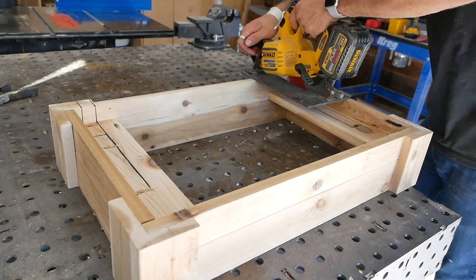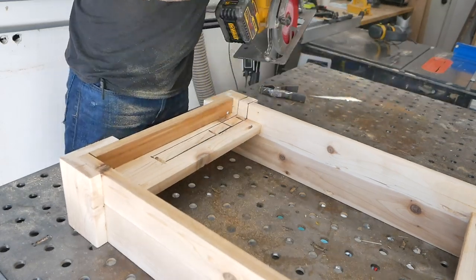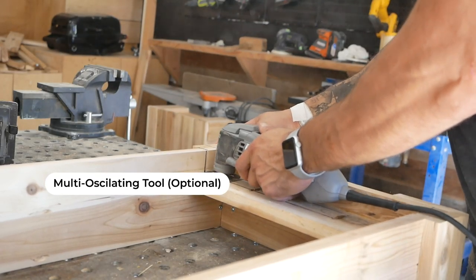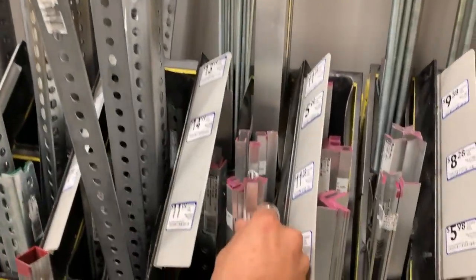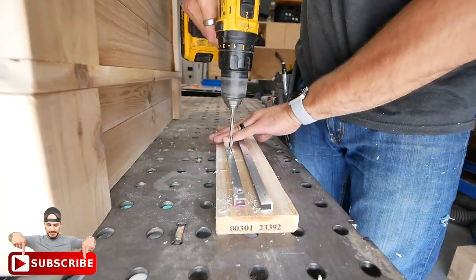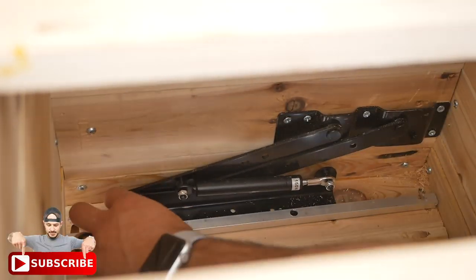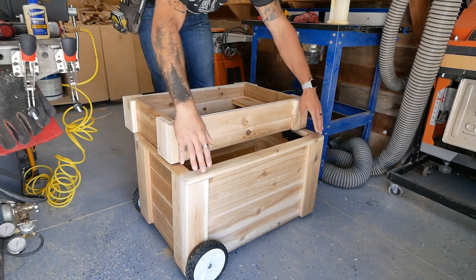One problem is that in order to access the cooler better, I needed this part to also slide out a little bit. I marked exactly where the channels would run, cut it out using my skill saw and a little multi-tool. Then I went to the hardware store and found a quarter-inch C-channel in the metal section. I thought we could fashion this in a way that would act like a slide after it lifted. So I trimmed it to size, drilled holes from both the top and bottom, slid it right into where the hardware would sit underneath the top, and secured it with four screws each.